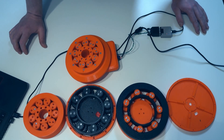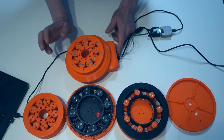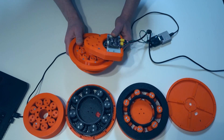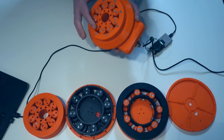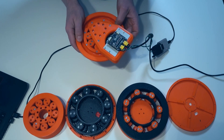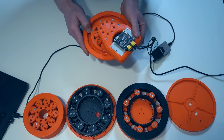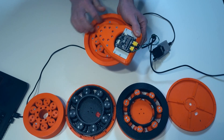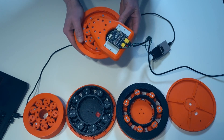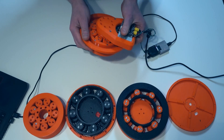I have not found how to reduce this sound, and I don't want a robot with four blenders in the wheels. So I decided to use a planetary gearbox as a wheel axis and reduce the input speed on the gear fed into the ring gear. It's this one. Finally, it looks like the best solution.